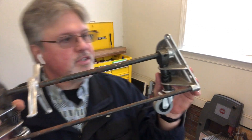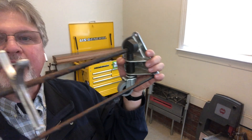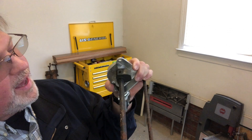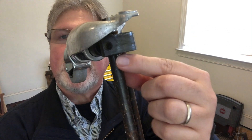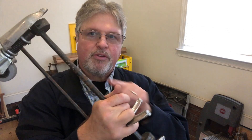One more thing to show you: as you're stepping on that pedal and rotating these cams through their various adjustment, there is a set screw that is holding that cam onto that rotating shaft, and there is a flat spot that that set screw tightens against. You may occasionally find that it doesn't lift properly — it may be because one or the other of those has gotten loose and is no longer in proper alignment. You can put a little bit of lubrication on this, either paste wax or Teflon spray. But don't put grease on it, because that's just going to attract dust.